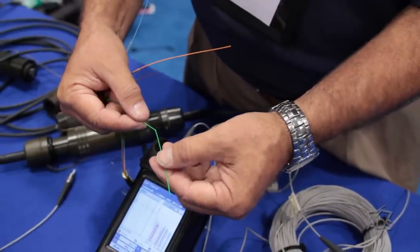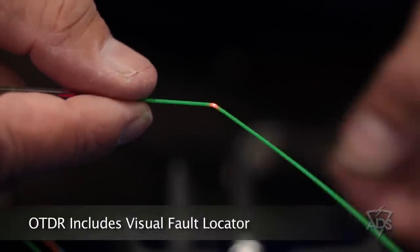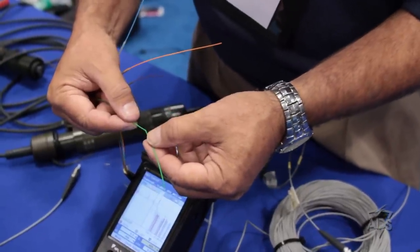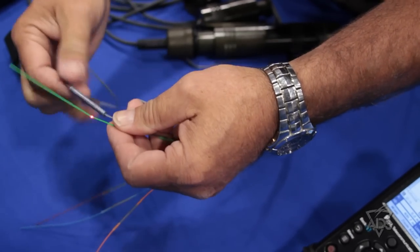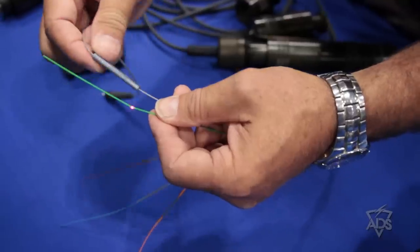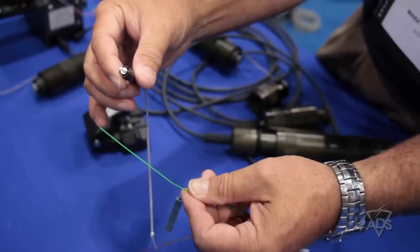One of the other functions built into the OTDR is a visual fault locator. This allows the technician to plug the fiber into the actual OTDR and find a fault on non-jacketed fiber within a pinpoint location. The Force One kit and the Fast Kit both come with a mechanical splice, allowing the technician to cut right at the point of break and do a very quick splice within about 10 minutes to a pre-terminated fiber that will restore comms within the shortest period possible.